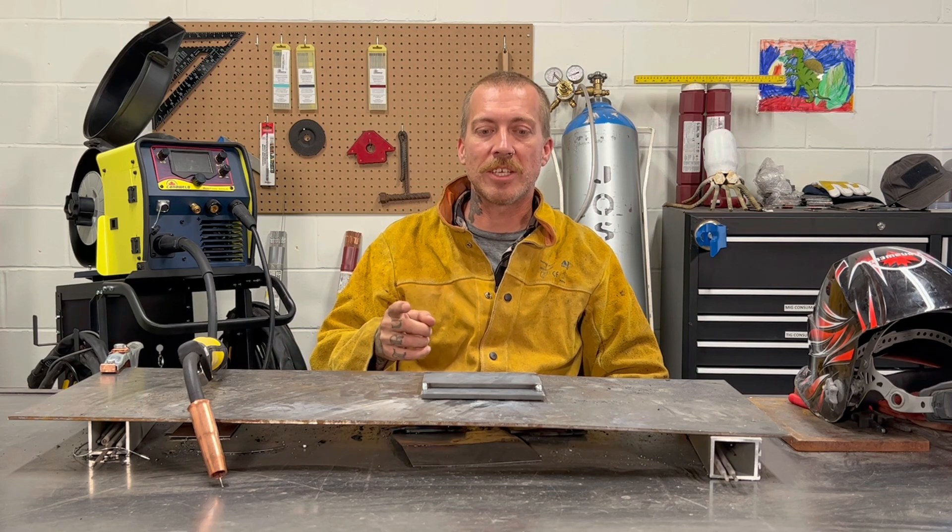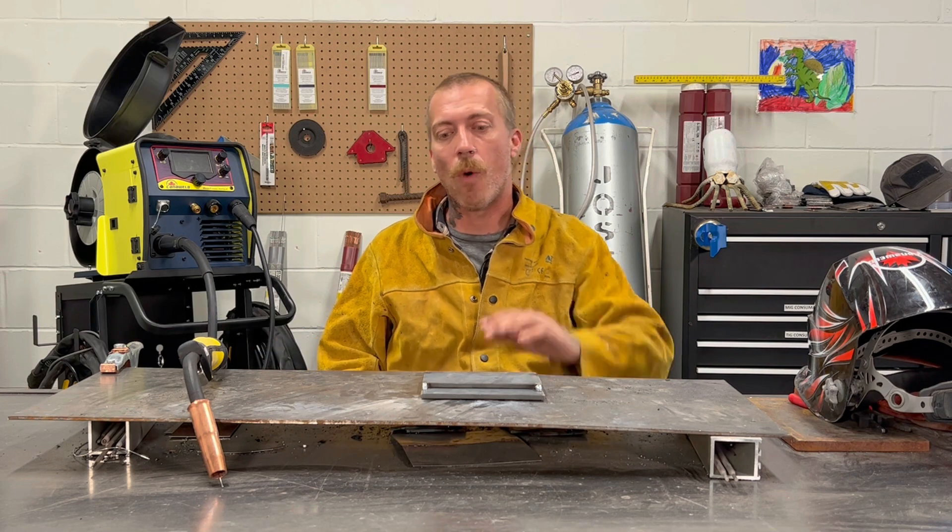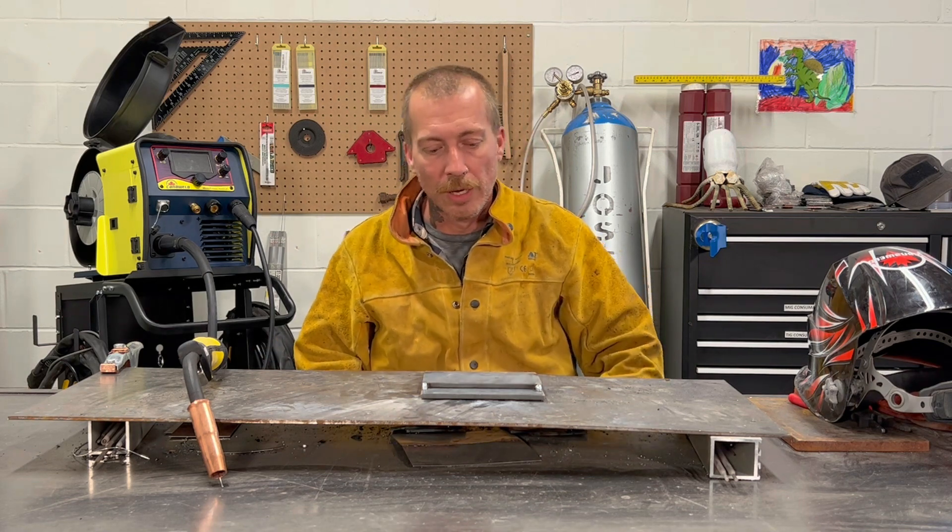So today we're going to focus on doing it with the MIG like I said, but hopefully you guys will be able to see the difference. Then next time you see a weld looking like that, you'll know exactly what the problem is and you can go adjust your regulator, get a new bottle of gas, get a wire wheel, clean it up real good, whatever.